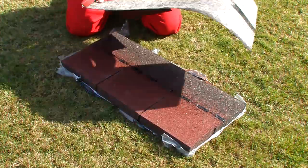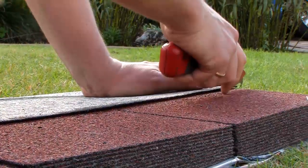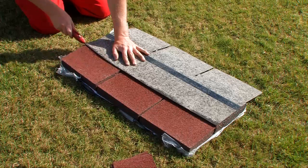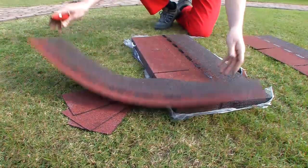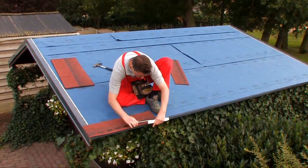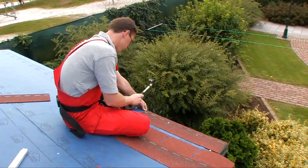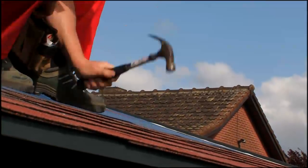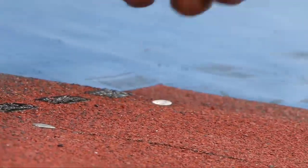When the easy shingle underlay is ready you can start placing the easy shingle. First cut the starter row from a shingle. Cut through the shingle lengthways at the tab cutout and across the shingle's full length. Allow this strip to protrude from the drip edge for 6 to 10 millimeters and nail it down. Always hit the nail straight in until the head presses onto the shingle surface but not into it. Make sure the nail doesn't damage the shingle surface.